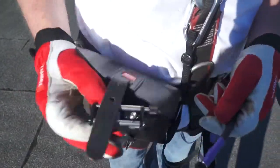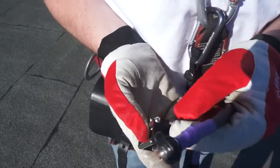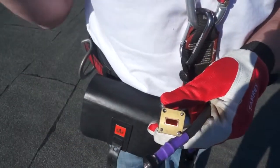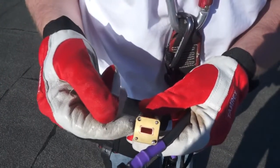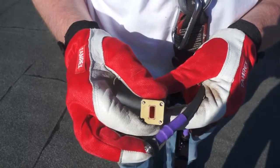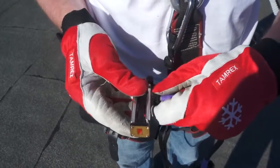Now to determine the polarity, I'm going to use this waveguide adapter. This is a 23 gigahertz model. It's got the SMA connector, quick thumb screws for attachment to the antenna, but it's also got this rectangular waveguide flange. So I can use it as a low-gain antenna to determine the polarity of the signal coming in this direction. Right now, as configured like this, this would be vertical polarization. And if I simply rotate it, that gives me horizontal polarization.